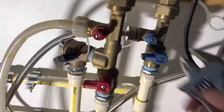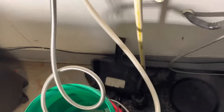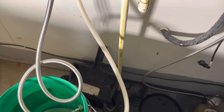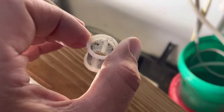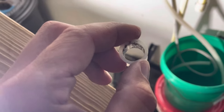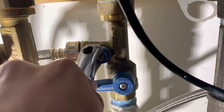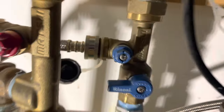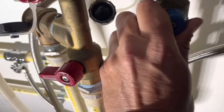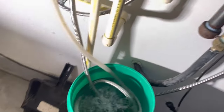We're going to open up our flush valves again and drain the water heater out. Now like I said at the beginning of the video, we're going to pull that screen out and check it again. Here's our screen after the flush — you can see we picked up a good amount of sediment there. We want to clean that off and get it put back. With our screen cleaned and reinstalled, we shut our cold flush valve and open our hot side, then open the cold supply and let water push out of the water heater into the bucket, flushing any remaining chemical out.